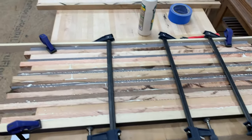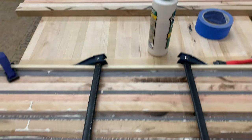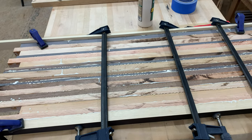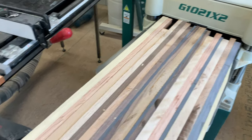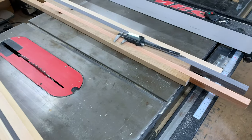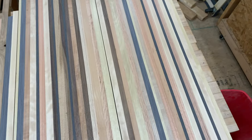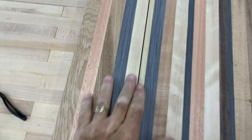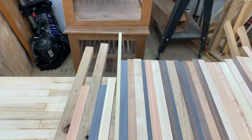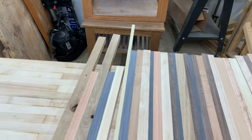Here's the first half glue-up — I got that glued up and I have the next section to do. I'm going to do it in three stages, not to exceed 15 inches, so it'll fit through the planer. I'm getting ready to put this through the planer. I have this piece already through — it looks nice. So we have our 30 inches. We have this one board here that's cracked, but we're going to cut that off because that's my snipe board extended out at the end.